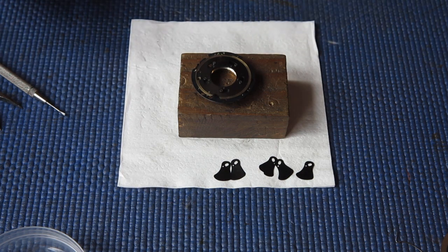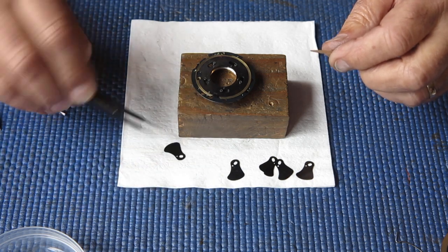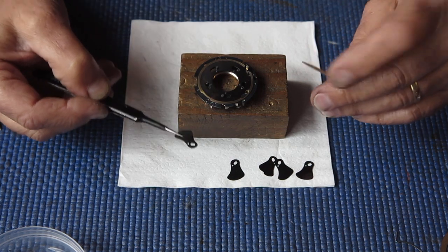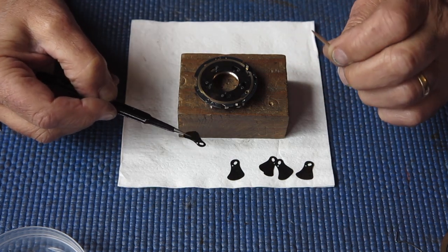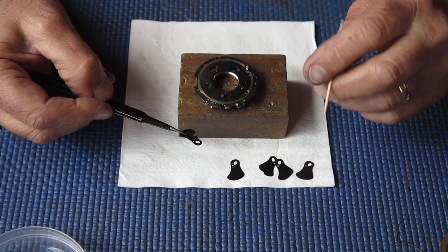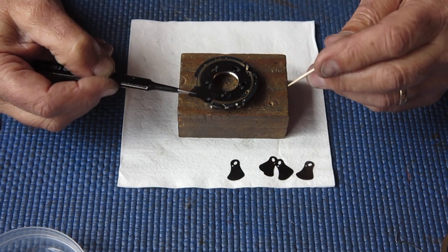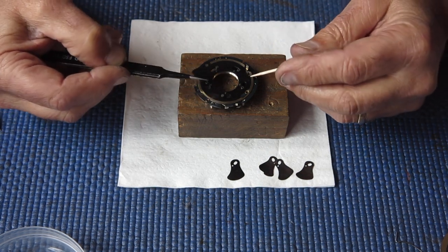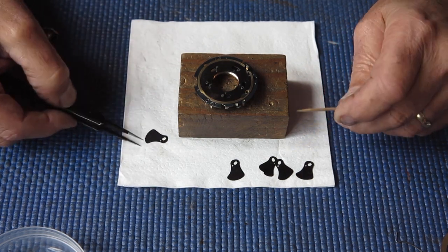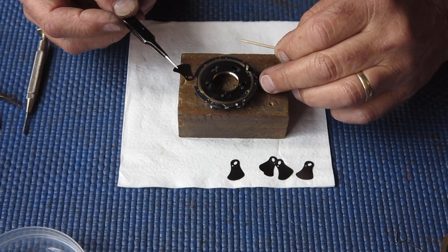And I'm going to place my shutter blades. With this shutter, there are two mechanisms for opening the blades. One is the traditional one from the blade actuating ring, and the second one is using this method for the preview, and that's done by moving the fixed pivot point. Normally you're moving the moving pivot point. In this shutter we can move the pivot points at both ends. So I've got to make sure I get this correct.